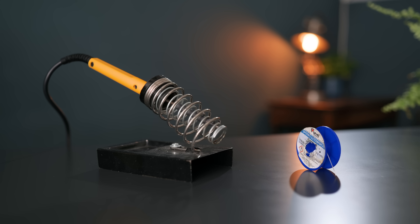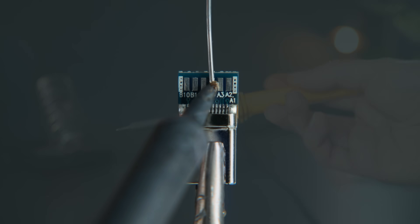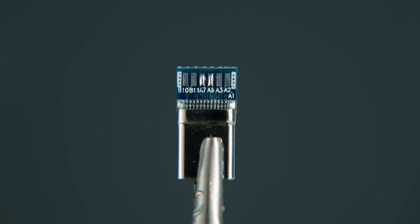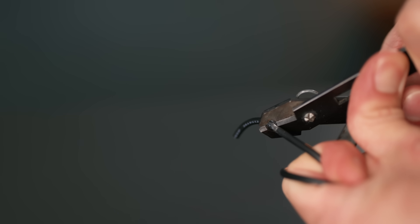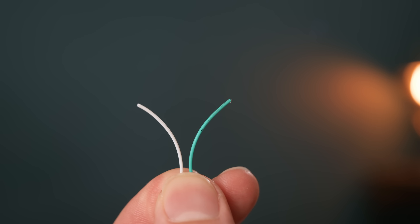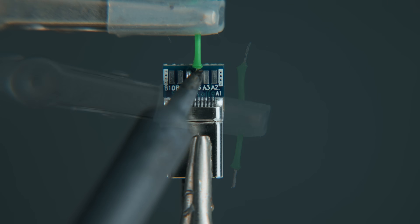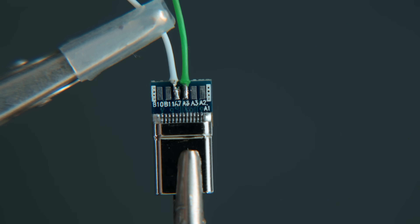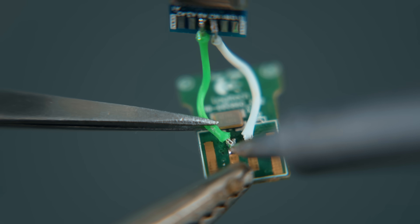For this step we'll need a soldering iron and some solder. Most of us will either have one of these already or know somebody who does, and if not, they're quite inexpensive from your local hardware store. So the first thing to do is add a dab of solder onto A7 and A6, after which they're ready for us to attach some wires. A good source for wire is actually an old USB cable, as most of us have plenty of these lying around. We can just use some wire cutters to open it up and pull out the little wires on the inside. As a general rule in the USB world, green and white are the data wires for USB 2.0 devices. As A6 corresponds to data positive, it can have a green wire attached, while A7 needs a white wire as it's data negative. Going back to the mouse receiver, we saw by observation earlier that one pad is data negative requiring the white wire, while the other is data positive requiring the green wire.